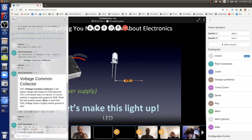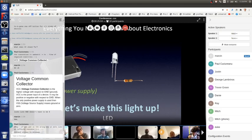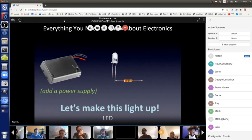You're right. We want to have that on the short wire because the minus side of our LED has to be negatively charged, and the long positive side of the diode has to be positively charged, so that the electrons are sucked across the diode junction, as they call it in semiconductor physics. That way the current flows in the direction it can flow, and thus emits photons, which we will perceive as light.